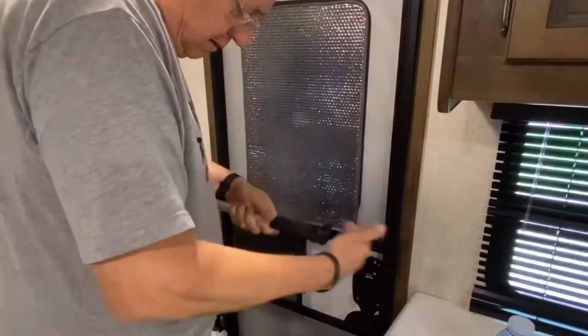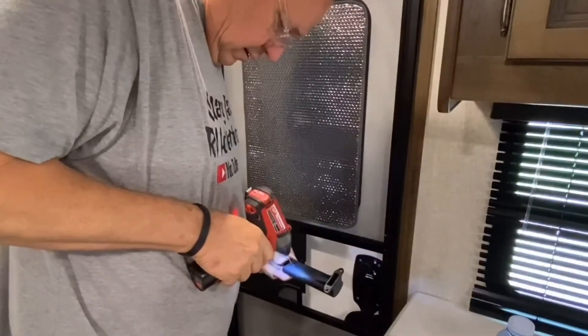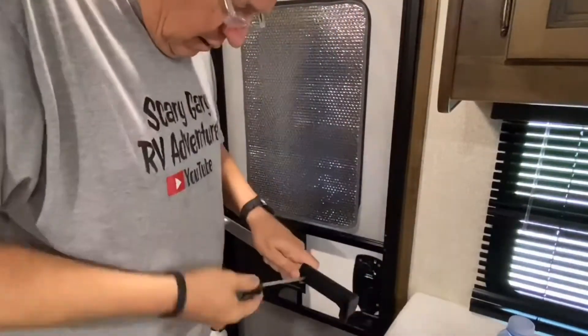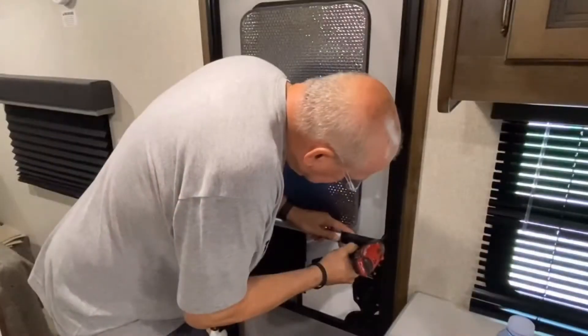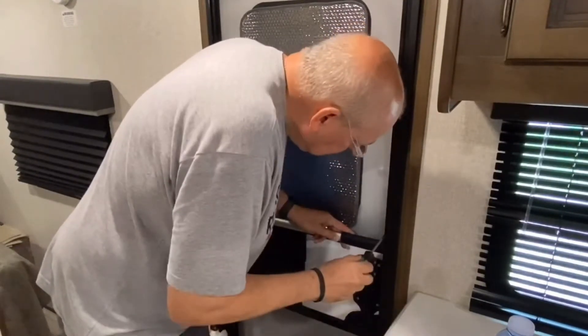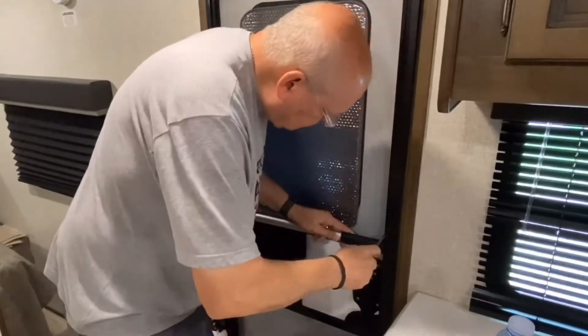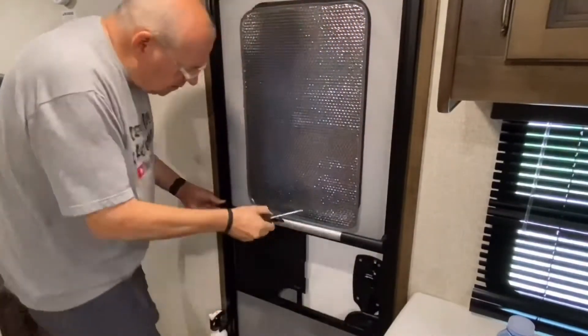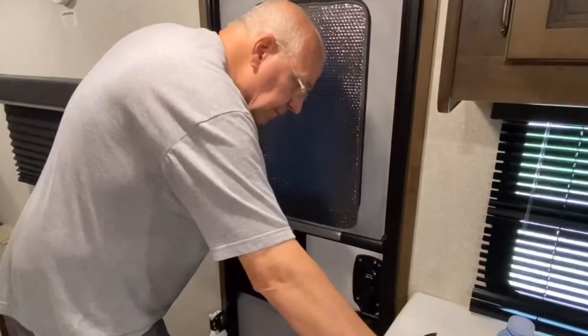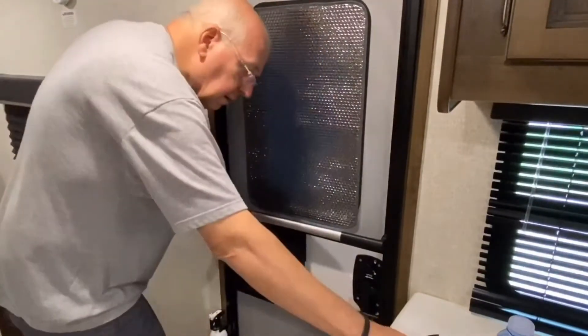Make sure the screws are at that specific edge. I set one side, adjusted the measurement, then set the other side — it's just a matter of screwing in a little screw that inserts in one end and the other side so the bar doesn't slide. Then figure out on the door where you're going to put it, drill through it, screw it in, do the other side making sure it's level, and there are just two other screws at the bottom. Very simple.